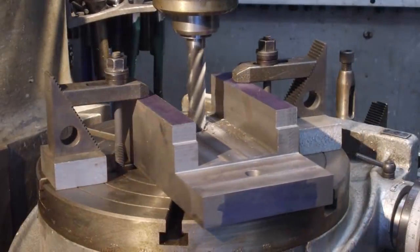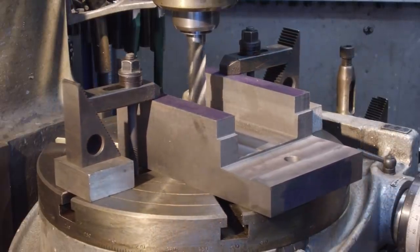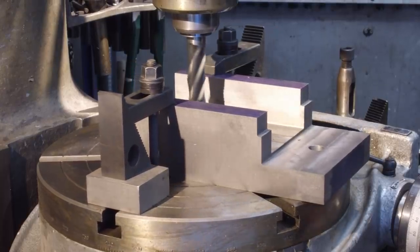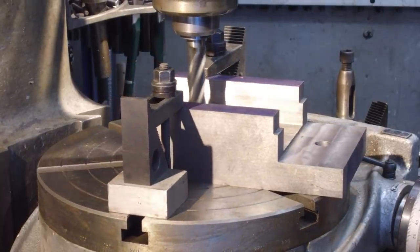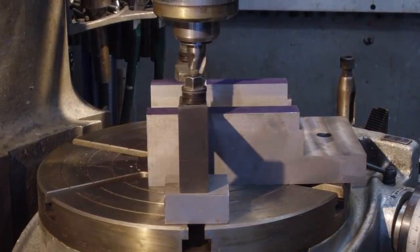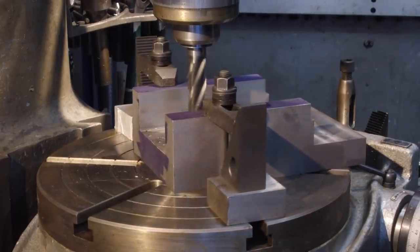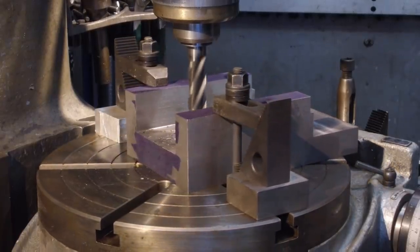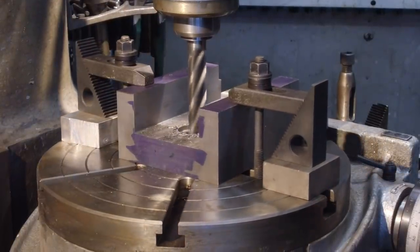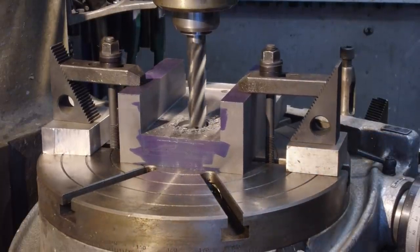Okay, this is as far out as we're gonna go from center. Quarter inch landing per side or on the radius for this keeper. We're gonna continue on around here, and then we're gonna drop it down to our finished depth that we want to set it at, and we'll come out with two cuts again. Okay, there's one cut around. You can hear it relieve the cut.